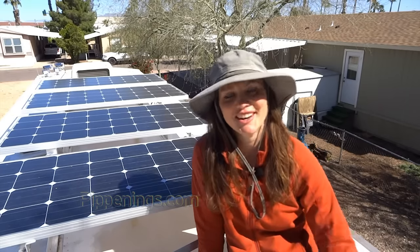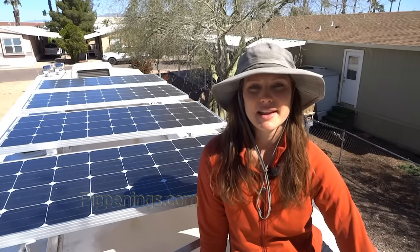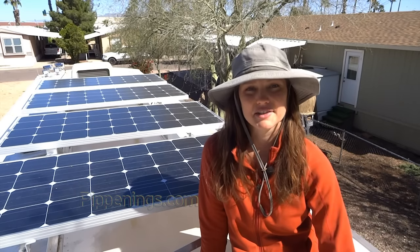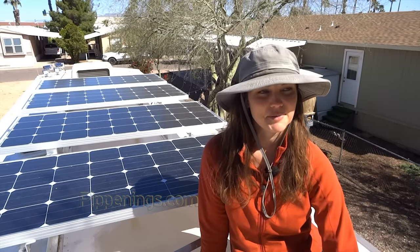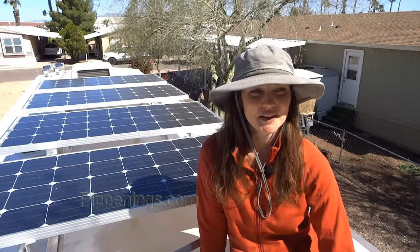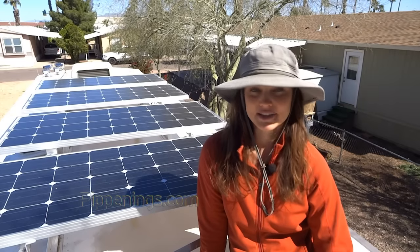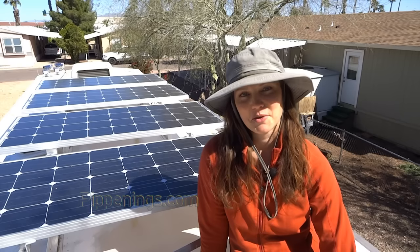I wonder if that's where that comes from. And now I need to know what ampacity, or how many amps, I'm gonna be running through that cable so I can determine the correct gauge wire to get. So this is where some decision making and creativity comes into play. As discussed in previous videos, the way in which you connect your panel arrays will either increase or maintain volts and/or amps. And by the way, this is the same exact information for batteries.